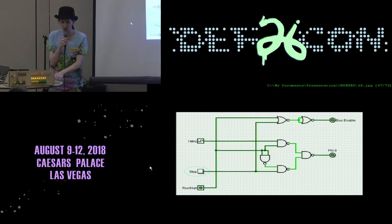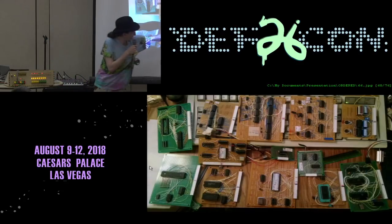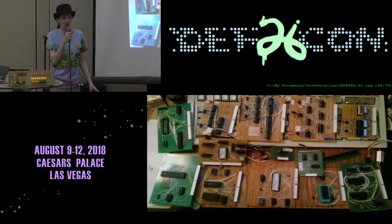After a while Thrashbarg says try this. I build it — doesn't work. So I try it the way I think it should be done: really just a multiplexer to choose between step and 1 MHz clock, with run-halt and bus enable. It sort of works, kind of — something I didn't expect to actually run. Once you get to serial routines it doesn't want to cooperate. The result is an entire pile of cards — some are duplicates. One card is for running a real NMOS CPU with mostly buffers to shut off the buses. Just last weekend at VCF West in Mountain View, California, the guy with the Monster 6502 was there. I connected up to it: first day had bus contention on one pin, second day we ran. It works with a real NMOS processor and also with the Monster.